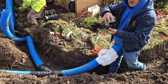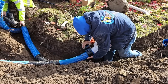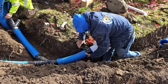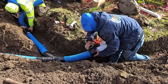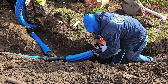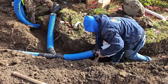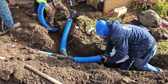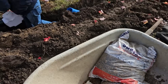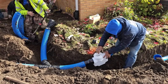We're using our inline catch basin for surface water. You can see how easy it hooks up — quick connect. The guys did drill holes in it and they are going to put a little fabric under it with some drainage stone. It's not going to require a lot of stone — we're actually just going to use some bagged stone. Since we didn't come in loaded with stone for a French drain, again, this is just a yard drain.